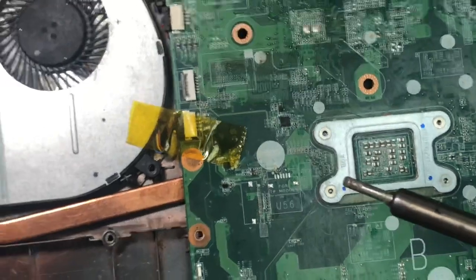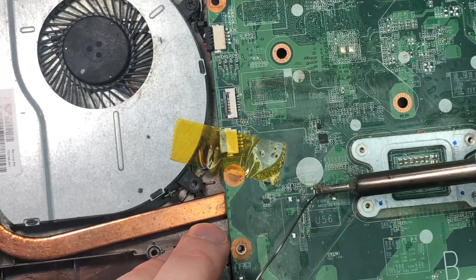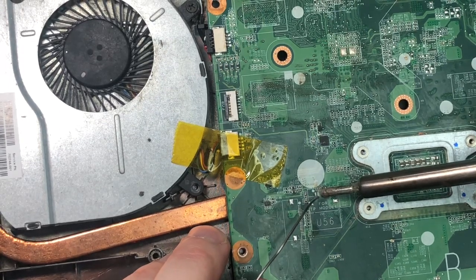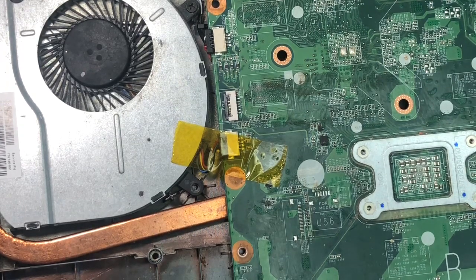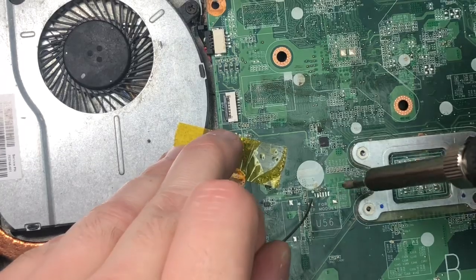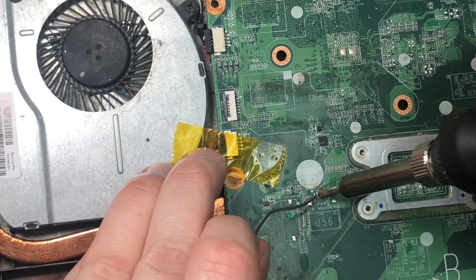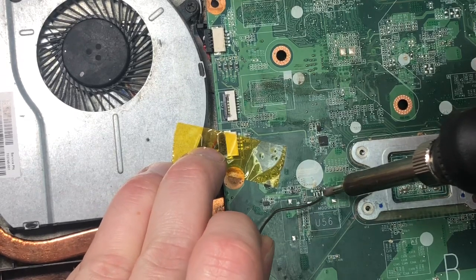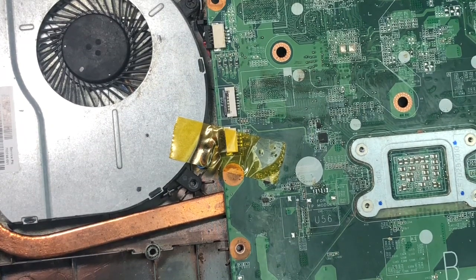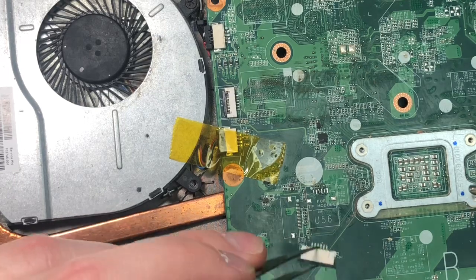I'll zoom down a little bit. I got enough room to work — I'm going to add to these pads, start away from here and work my way back. I'm just going to add a little bit of solder back onto these pads so I have something to adhere to. I'm having problems because it's a larger tip and it likes to soak up the solder. If I had finer solder it would have been a lot better. Okay, we got that — smooth that out. Typically when doing parts like this, you do one pin, then go over to the other side, do the other pin, then solder the rest down.